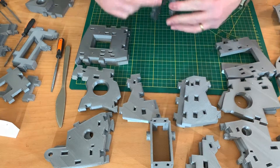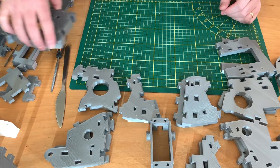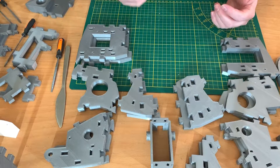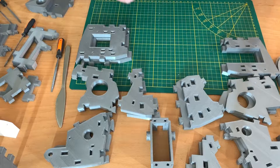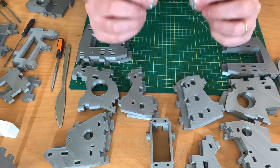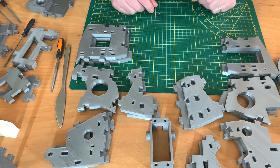This part is ready and now we are going to put the pieces together and arrange them. Some parts, as you can see, have both male and female connections. There are some parts on the back side and on the front side, so you have to make sure that all the parts you are going to use are aligned and on the right side. Also make sure that when you print everything, those two pieces are also in your back torso panel, because those are used to put the servo holders for the neck parts. Now we are going to put together the pieces for the back side.